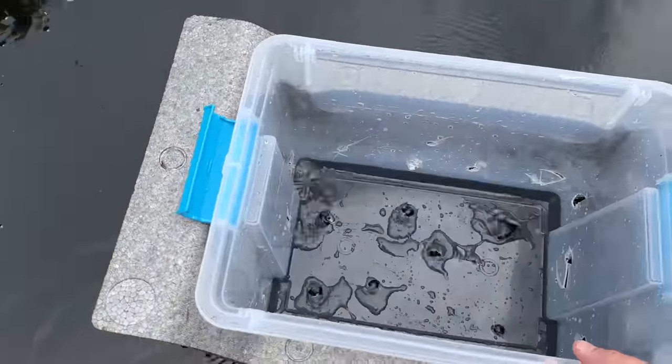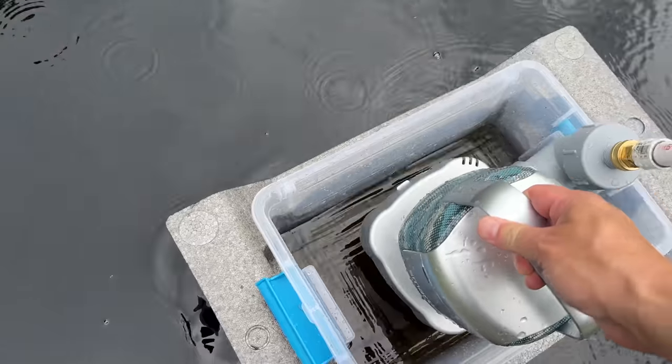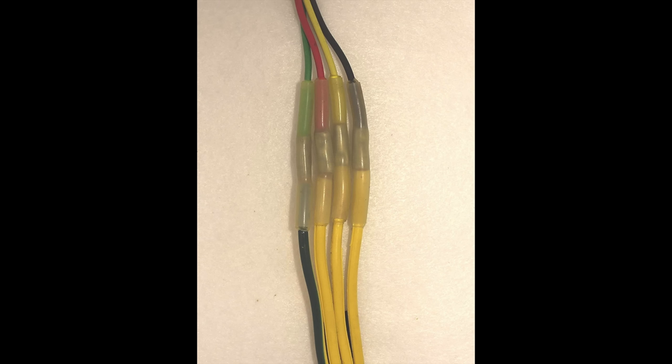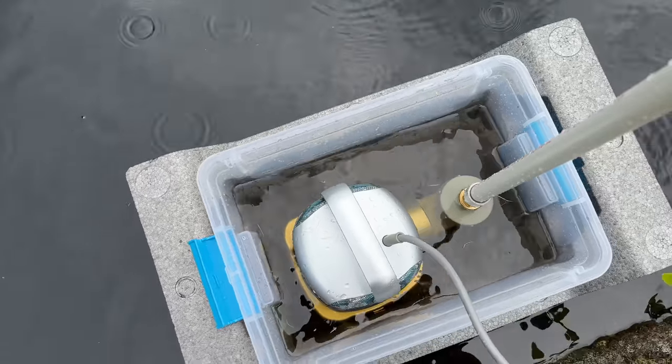The other thing you'll notice is this floating design is self-leveling. As soon as it fills up with water, all I need to do is put in my pump. A lot of utility pumps don't have particularly long electric cords, but you can actually extend them. You'd start by finding a suitable electric cord, but then you need to splice them — I'd recommend using well splices, which are designed to be completely submerged for years and are really reliable.